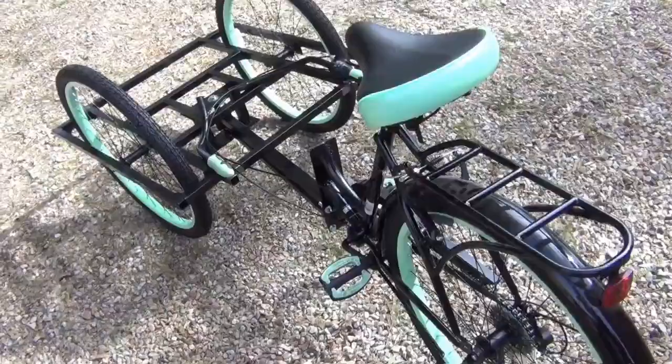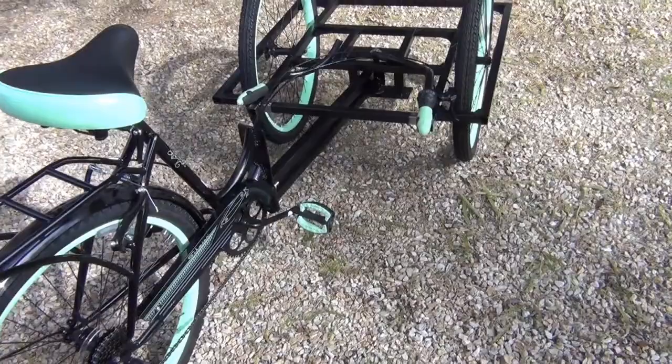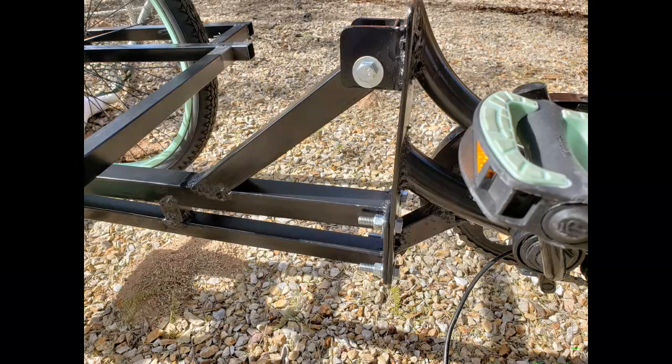After welding another piece of steel to the bike frame at the point of the initial cut, I'm able to connect the cart frame to the rear end of the bicycle. At this point, the handlebars are simply resting on the frame and are not attached. As you can see, it's starting to come together — I'd say it's about 75% done here. In this close-up, you can see the attachment point. It's imperative to make this area strong or you risk failure when weight is added to the seat. I added extra bracing in the areas indicated with the blue arrows.